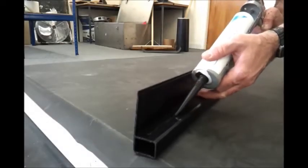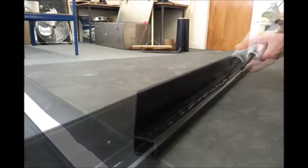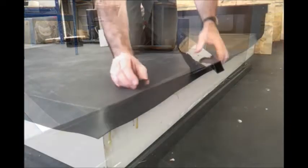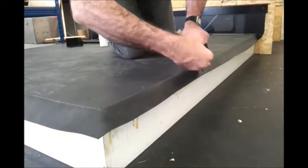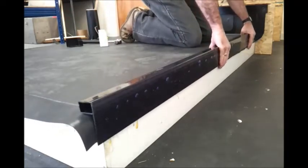In this one we're going to put our perm roof edge detail onto the curb edge. We're going to apply some perm roof bond and seal to the underside of the trim. It is a hollow section profile so we need to cap off the end with a small end cap, and then offer it into position onto the edge of the roof.